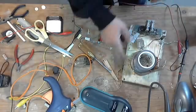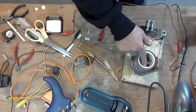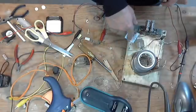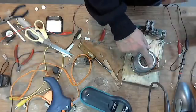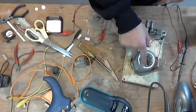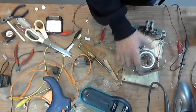What's different tonight is I'm using three-quarter inch diameter disc magnets that are half inch thick — Neodymium N42s, I believe. And they are at a 60-degree angle to one another. There are six of them in the drum now, as opposed to four of the large rectangular magnets.